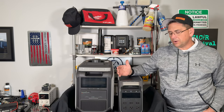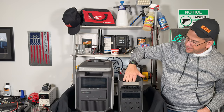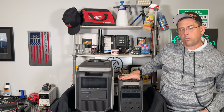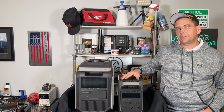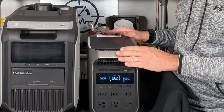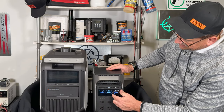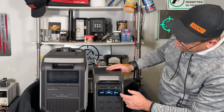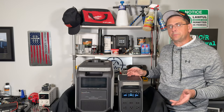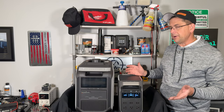Some of the improvements on the Delta III compared to the Delta II include a lot of work on sound. They moved the fans to the front and back so it pulls air through the front and out through the back, keeping the unit cool and quiet. Even under a hard load it only puts out about 40-some dB. They also copied the design of the Delta Pro III with a similar display on the front — very easy to read input and output wattage, battery life, and charge speed. They improved the UPS switchover speed to as little as 10 milliseconds, which should work for about any computer, even under hard gaming conditions.